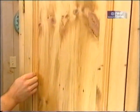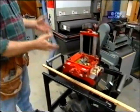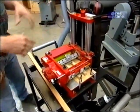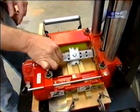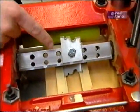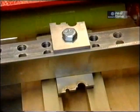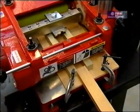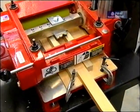I could try to make this with my router, but I wouldn't even come close to this profile — it's a very classic look. You're not going to find this molding at the home center or even at a good lumber yard. You could go to a millwork company where they'd cut a set of knives and run some stock for you, but there's a minimum charge for that. We're lucky here in the workshop because we recently got a molding machine from a friend of the show. I've taken off the dust collection. There's a motor below that drives a cutter head. I faxed a section of the profile of the molding up to the manufacturer, and they cut these two knives. When the knives come back, I simply bolt them into the head, then create a little guide system made out of plywood and stops clamped to the bed, and it just guides the square or rough stock through the machine. There's an in-feed roller which pushes it through the knives.